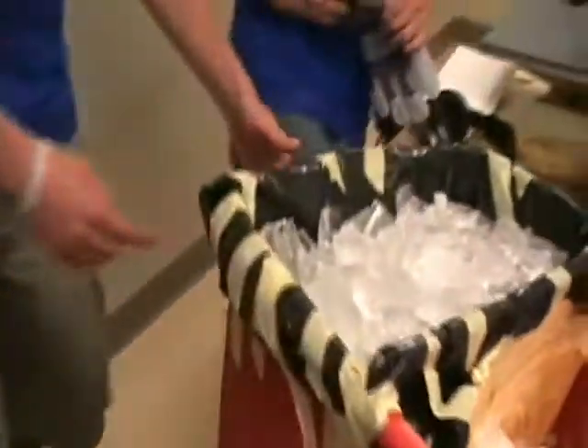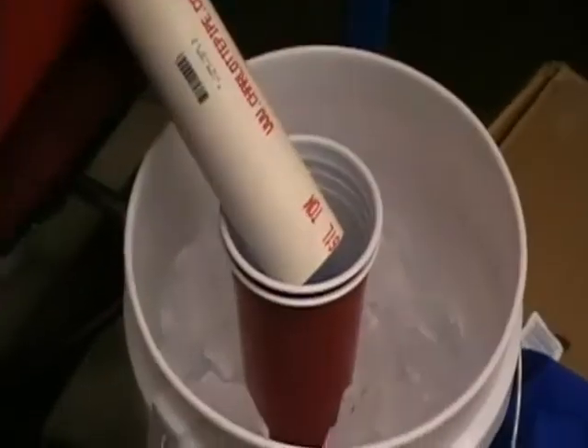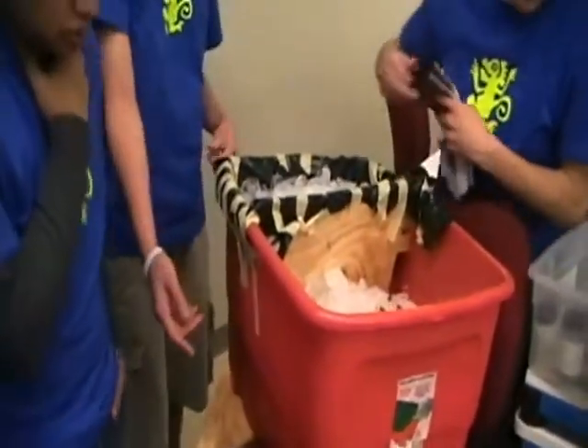If you can't see behind, there's an elbow going in at an angle in here, and as you can see, there's ice filling this whole entire bucket. So there's steam flowing through the PVC, and as it's going in here, because of the ice, all the steam should condense in the water, and as the steam goes, water is condensing and is dripping into the cup and is gradually being collected.